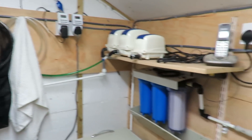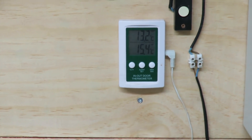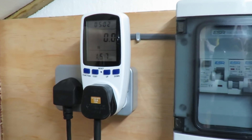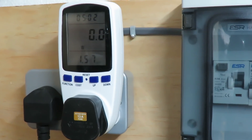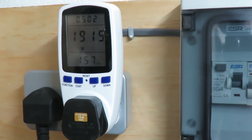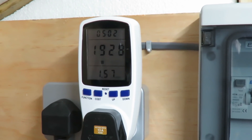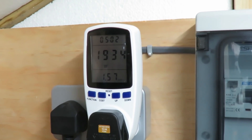It's now six o'clock at night. The temperature in the RDF - which is what's going back to the pond - is between 13.2 and 13.3, so it's holding that temperature. The heater itself is now cutting out. It did run for nearly two hours solid, and the amazing part is on the bottom it's cost one pound fifty. That is going to be more expensive because it's heating the pond up - it's cut back in again because the pond isn't quiet at 13 degrees yet, so it is going to cut in and out more, but it ran for nearly two hours solid before it cut out.